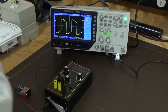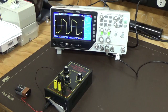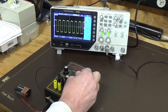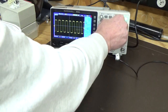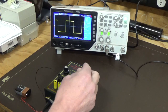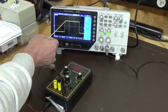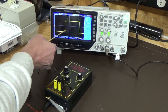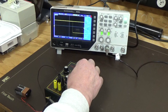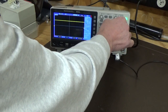Yeah, you see you start going to distortion. So we're at 1K but at a frequency of 90 Hertz there. Starting to flatten out top and bottom, and still a little bit of curvature there. So you're around about that, say 300 Hertz I'd say. So probably 300 Hertz up to, if we take it to 10K, showing just a little bit of rounding off on the top edge of your square wave. We take it down to the lower frequency of that range, and we expand that out.